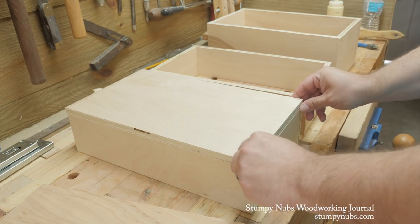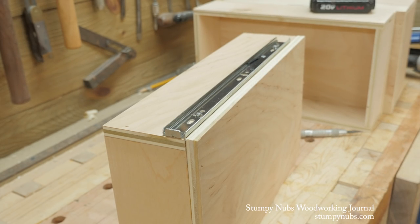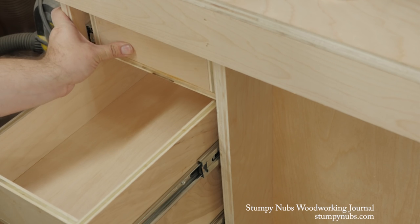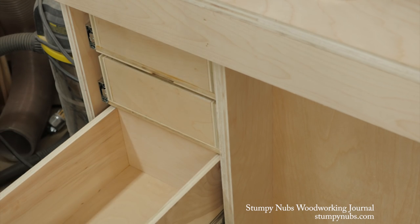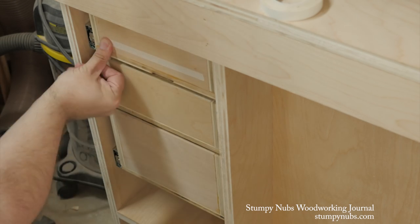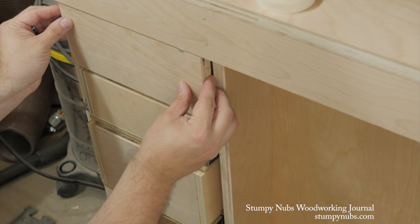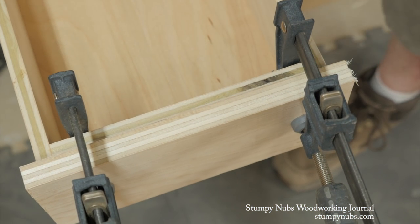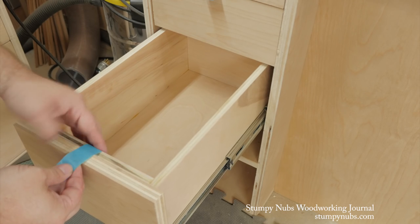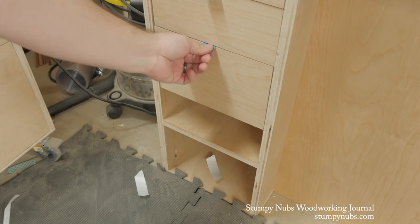There are three drawers for storage, and they're just simple plywood boxes. I like to use ball-bearing drawer slides, even on shop furniture like this. They may cost more, but they sure work nicely. I mounted the drawer boxes so that the setback from the front of the cabinet was three-quarters of an inch. This allows me room to mount some drawer fronts. I like to make my drawers this way because it's really easy to align the faces. I use double-sided tape to temporarily attach them and washers to get the spacing right, then drive screws from the inside of the box to secure the faces permanently. I always use tape as temporary drawer pulls — beats using a screwdriver to open them if they're closed accidentally before the permanent pulls are mounted.